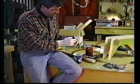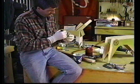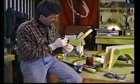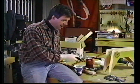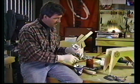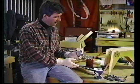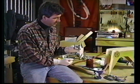We've already sanded the inside with 36 grit, which, by the way, I'll give you the real skinny on this. Truth of the matter is that the actual bonding to this casting is not nearly so important as an accurate casting. And that's what we're doing. We're casting or potting this strut into this part. We're not depending on bond here. We're depending on closeness of fit. And while you do this, make sure you don't get resin on this center pin. It would be an ugly affair.